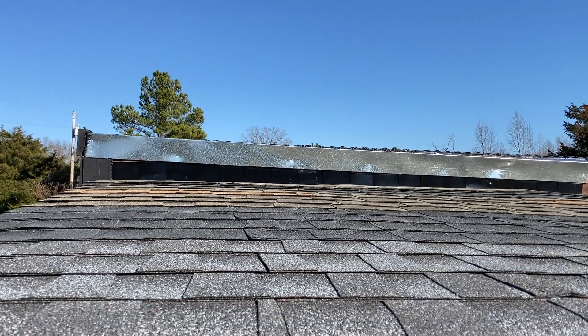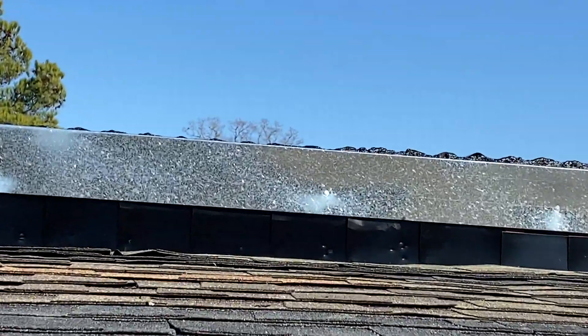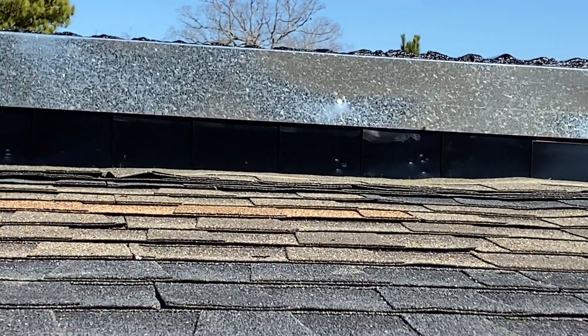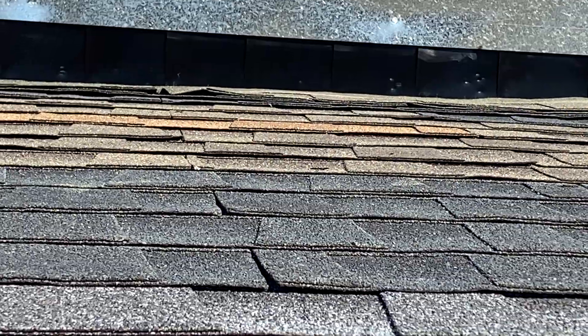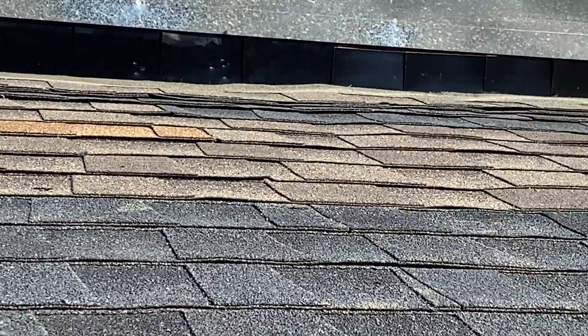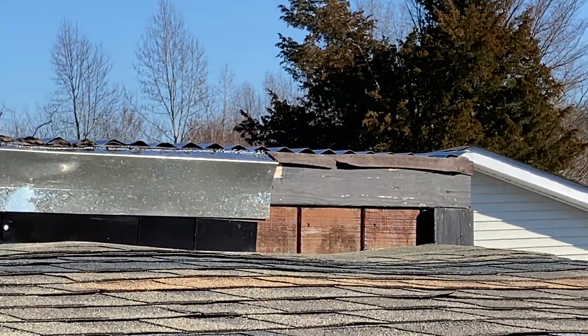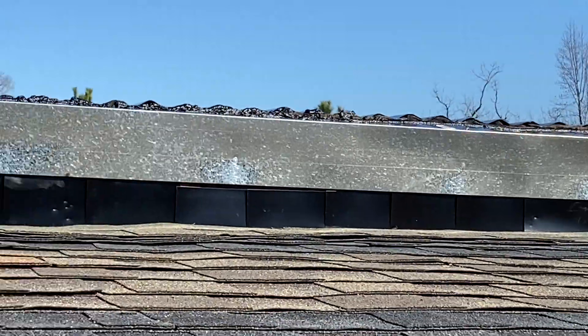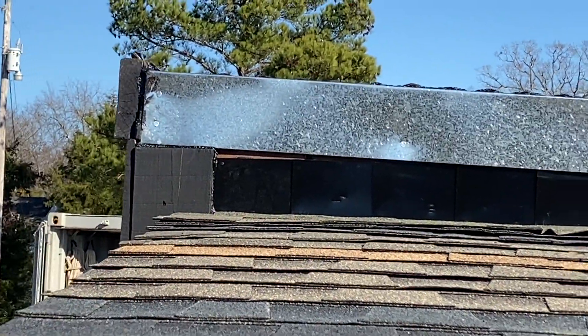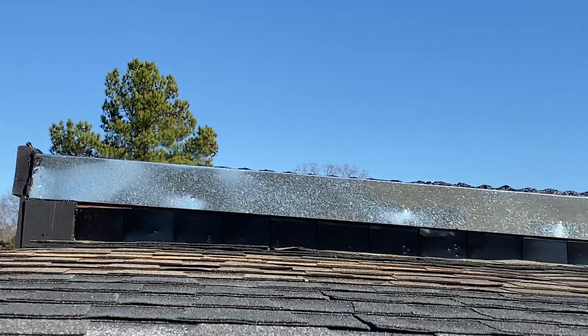Here was the fix and as you can see there's a big old box of flashing up there, plus there's flashing underneath. The shingles are tucked all the way in. All finished now — that corner over there didn't need it because it's not leaking. My main leak was right there in this entire corner, so I got that fixed.